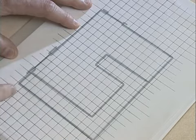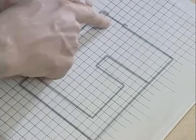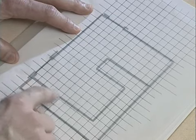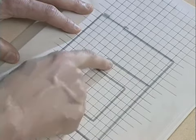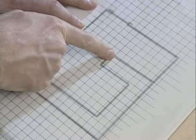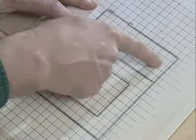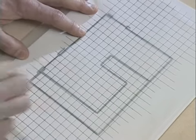Now that's east and west. We want to do the same thing north and south. Again, an entrance here, so let's put full tiles right up against that area. Come down to the other side. How are these tiles looking? Again, fairly thick. Now these are relatively thin along this cabinet, but at the same time, they are going to be underneath the toe space here, and more than likely in a space like this, there probably would be a table, so they wouldn't be real noticeable past that table. So I think this is probably a pretty good position for the tile in this space.